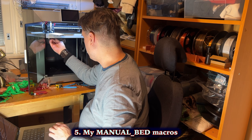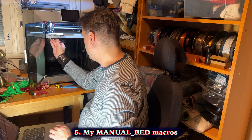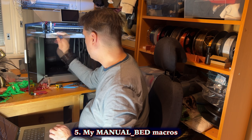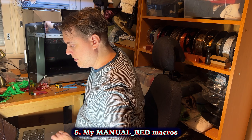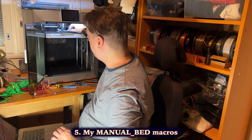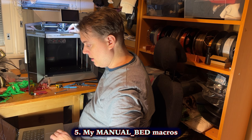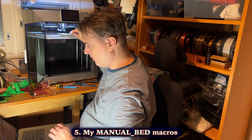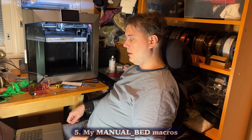It can go out of adjustment when you tighten it, so you may need to leave it slightly loose first, then tighten. Two again, three is good. There is also Manual Bed Center, but there's no adjustment for it — it's only if you're curious to see. Once you're done, hit Manual Bed Finish. It homes the Z axis properly as well. Like that, you're done.